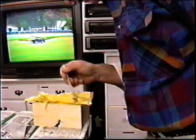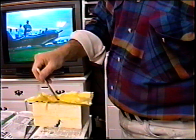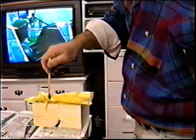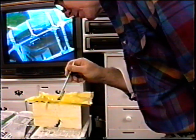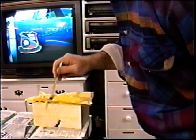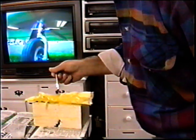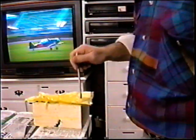See, it's really difficult to get this to conform to the shape. I've had to take a razor blade and try to put slits in this. It's hard to even cut this with a double-edged razor, so I'm looking forward to seeing if John can get us any information on cutting Kevlar in case we decide we want to use this in the future. It certainly is a little bit higher tech material than using e-glass, but again, the problem is the workability and the price, but hey, you're always better off if you can do a little test or experiment. At least find out that there are some downsides you don't want to live with.